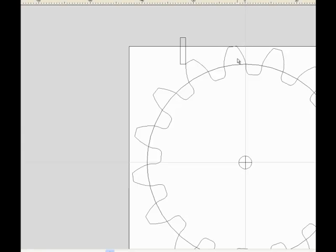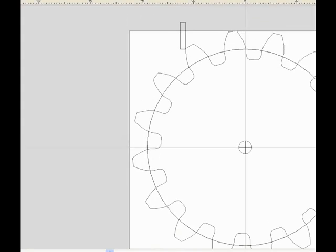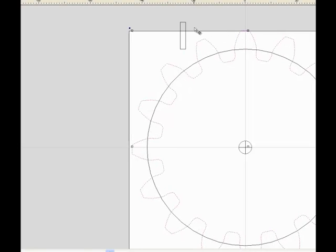In an epicycloidal, it would be possible to rewrite the relationship between the tool travel and the flank of the tooth to be sinusoidal rather than involute, but that would not solve the problem when it came to sprockets and timing gears, which follow some pretty strange math, and oftentimes they're simply random concatenations of arcs, which would make it almost impossible for me to come up with an algorithm which can reliably cut them on a fourth axis. I think that we've come up with a pretty good solution though, and we'll discuss that now that we're going into Gearotic Motion to look at the new fourth axis module.